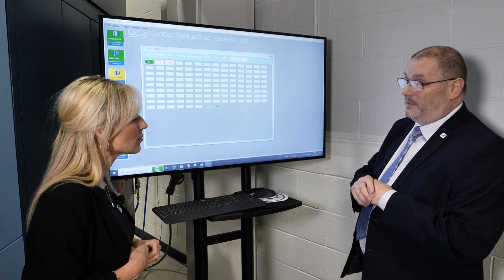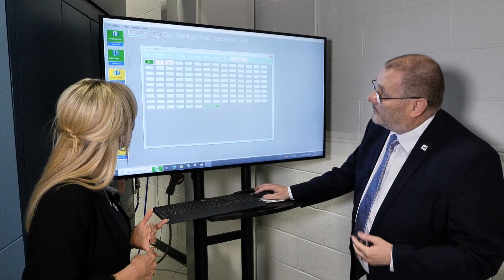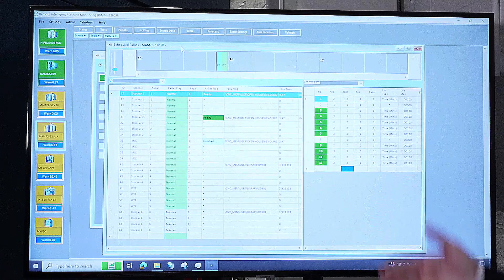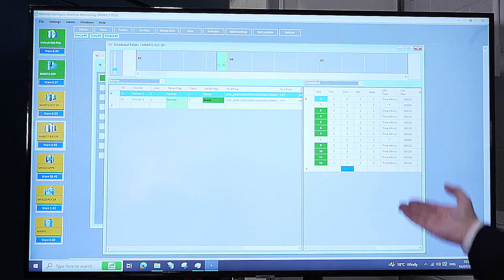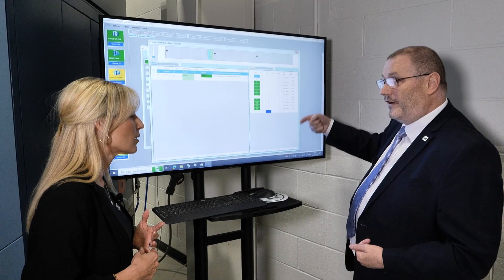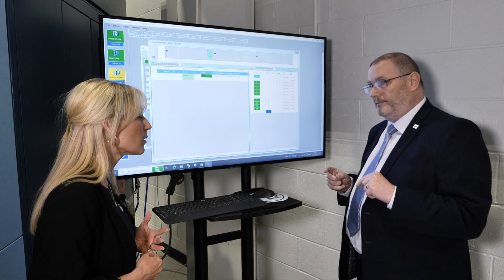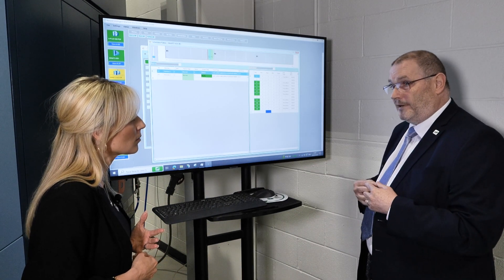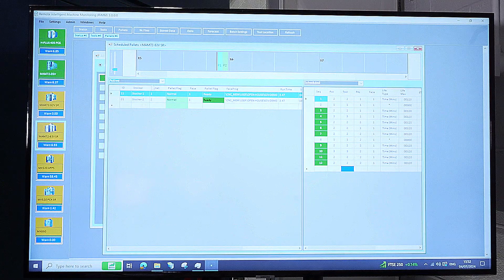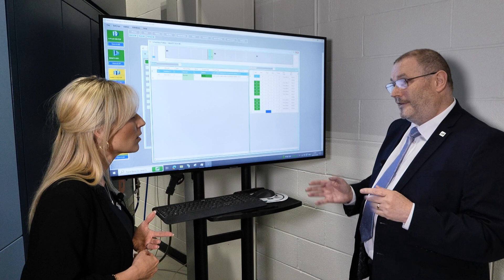RIM will look after three types of tool management. One for pure unmanned running — it tells you what tools are running. If I show you the pallet system, these are all the pallets which are active on the machine. You can filter down to active pallets, and these are all the tools required, looking at the status of every tool and forecasting tool life. The intelligent part: if it has no information on the program you're running, it will automatically extract all the tools from the program and teach itself the overall run time, process time for each tool, and cut time for each tool. When you run that program again, it's now predicting tool life. Because it's coming from the machine, it's very, very accurate — if you rely on the CAM system, you could be miles out.